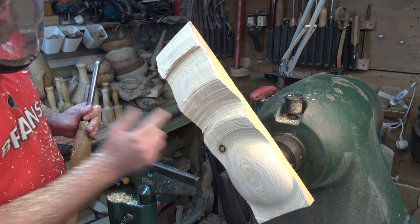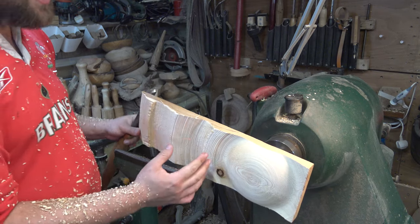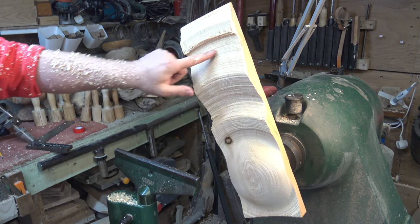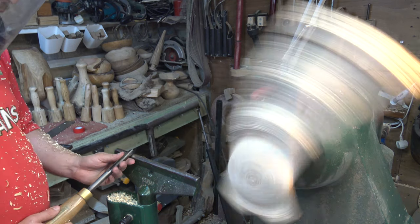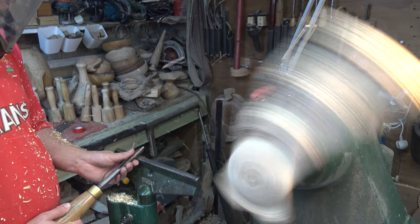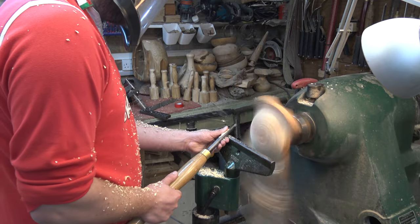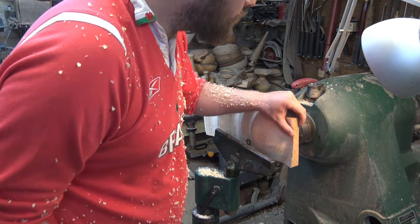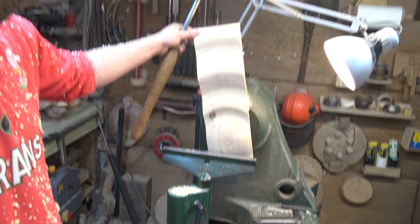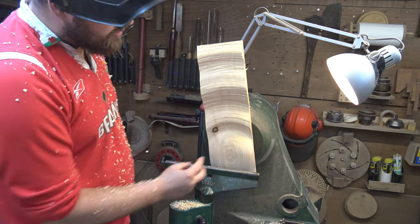By really cutting downhill I'm starting to smooth these cuts. I don't want to sand all these ridges away when I come to doing the finish — I want people to see that this is actually being turned, not just cut out on a bandsaw. You can see we've got perfect curves to help us do that. I'm happy with all those curves I've got in there. You can see it's going to be the outside shape of the Arty Flame Bowl, and we're going to want to keep those turning curves for later on.